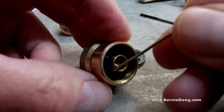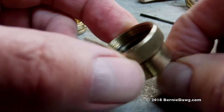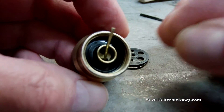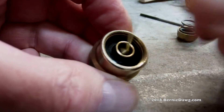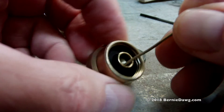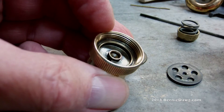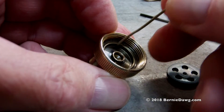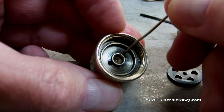These safety release caps are different from those you see from Optimus, because of the two holes in the center that go through into that inner chamber. The seal inside the safety release valve cap is always kept wet or damp by fuel, so it's basically bathed in fuel pretty much all the time. With normal sloshing about, you can even end up with little puddles of fuel inside this inner chamber that's constantly in contact with this big rubber seal.